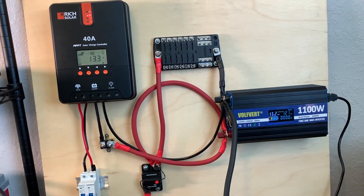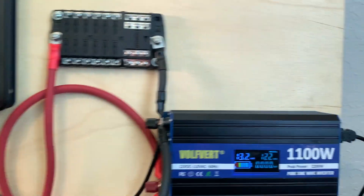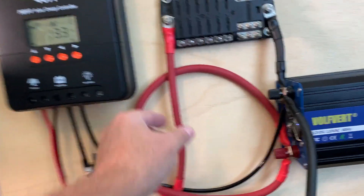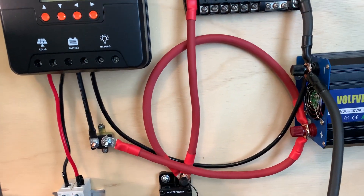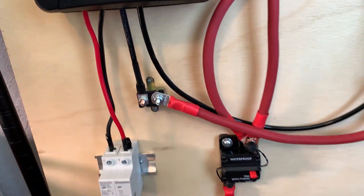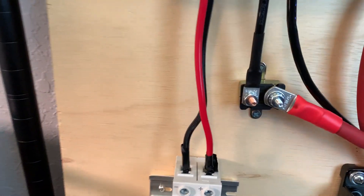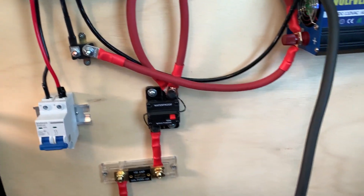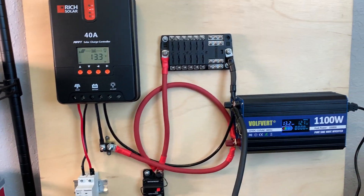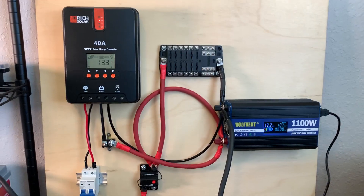I've talked too long — now I've got to learn this stuff. I need to get into the manual for the solar charge controller and the inverter. But hey, we're powering up, it's working, nothing's smoking, nothing's hot. I did oversize all the wire — I used two-gauge, which is bigger than you really need. This section is six-gauge only because that's the largest that would fit in the solar charge controller opening. Everything's fused with breakers, so it should be pretty safe. My hair didn't get fried and curly, so I'm happy about that. Lights are running — let me know what you guys think. All the best.